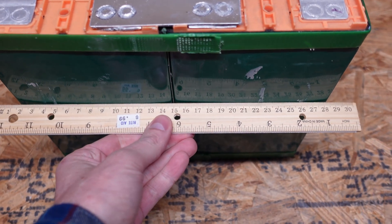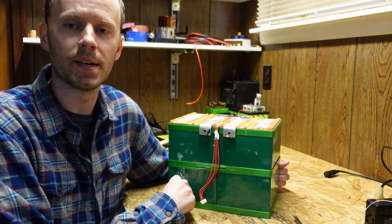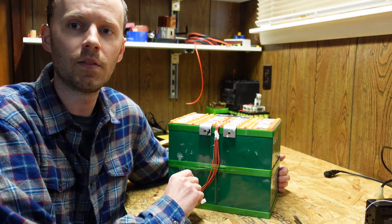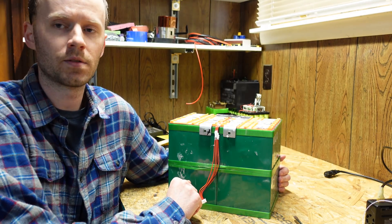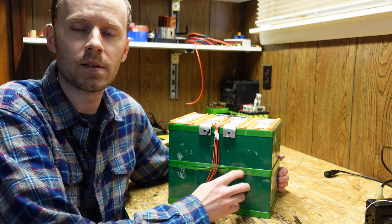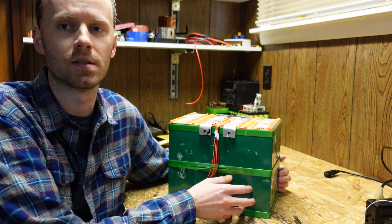They're just not as obvious. Holding this ruler up to it, you can see especially on the edges where it's bulging out — more on the left side than the right side. I know with lithium iron phosphate, around 2 volts is typically the point where people say there is permanent damage if discharged below that. Others say as long as the cell isn't below 2 volts for an extended duration, there's typically no harm trying to recover them. I have a new 100 amp BMS on order. The big question is whether that 0-volt cell grouping is self-discharging due to internal shorts — the 34 millivolt drop versus 3 to 6 in other groups is concerning, though we can't say with certainty until it's charged and rebalanced.